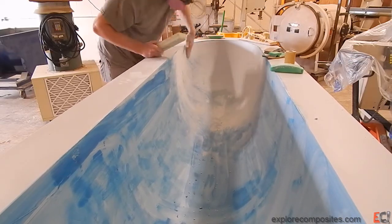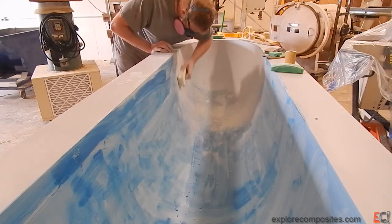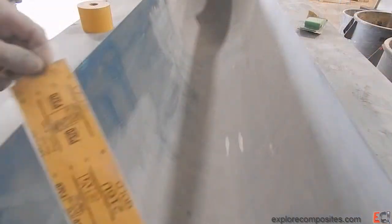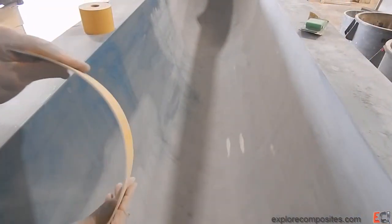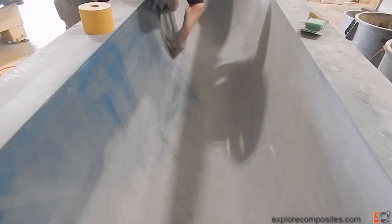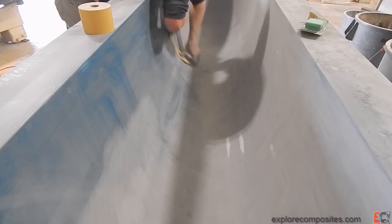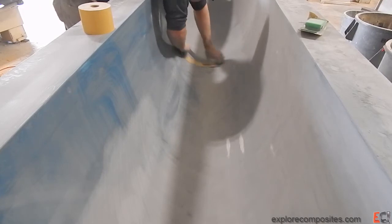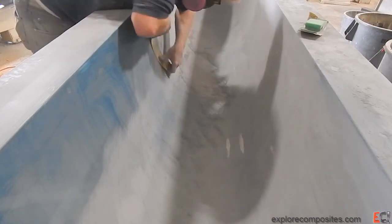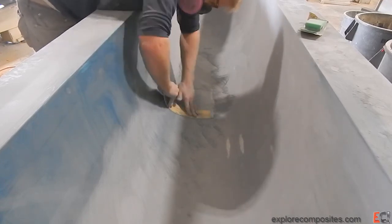It's a strange sort of fairness there that came out of the computer model, and it's a little bit of a hassle to get it nice. I'm using a sheet of Lexan or acrylic with some sandpaper on it — this is nice because it conforms and fairs the inside curvature across the strips. The strips printing through just gives you little longitudinal wrinkles in the part. This helps a lot: sanding the high spots, letting the low spots stay full of primer. Went over the whole thing this way and it made a pretty good difference.